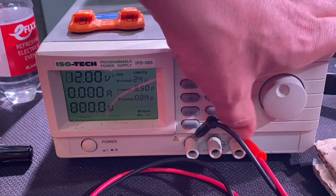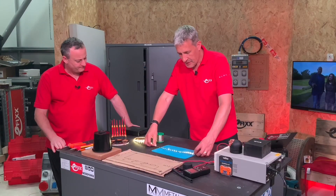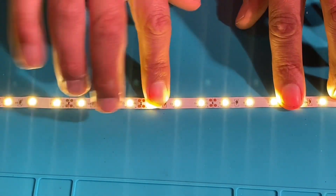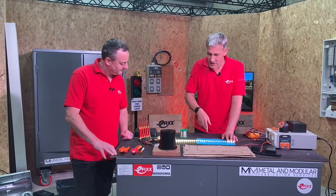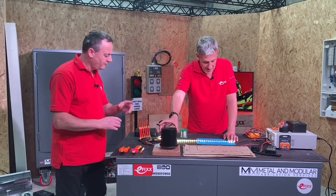So we're going to power it up. That is a 12 volt LED strip, five meters long, and the packaging claims it's 18 watts. But if I look at the power supply, there's the first problem — it's actually 12 watts. So someone's been telling a few porkies there, or they may have made an improvement in LED efficiency.